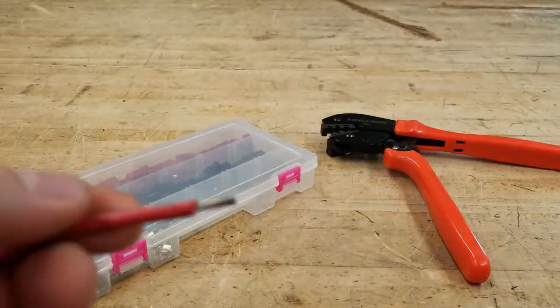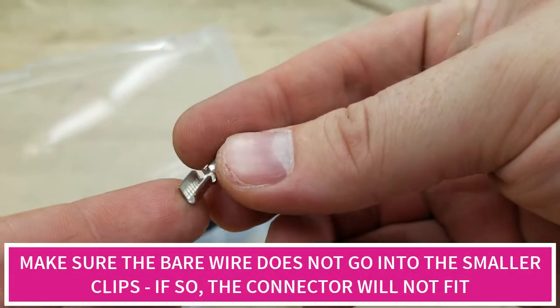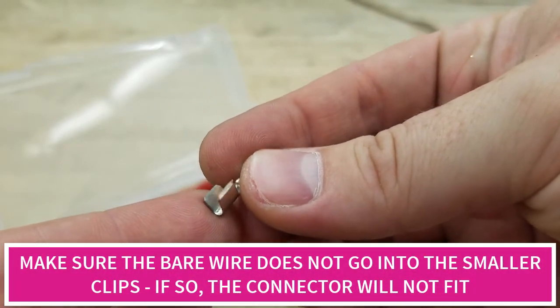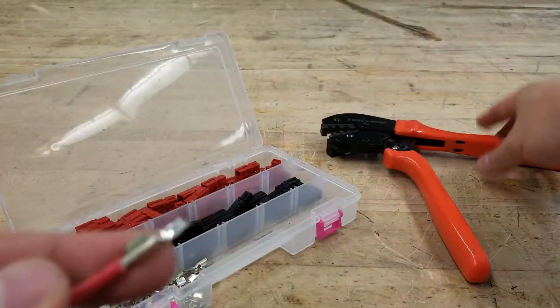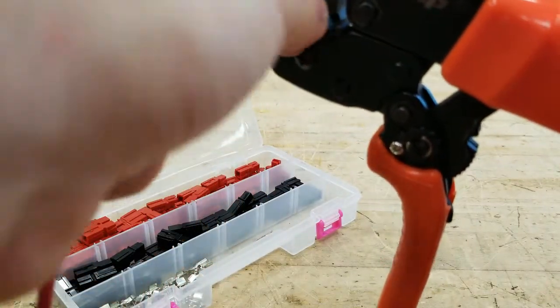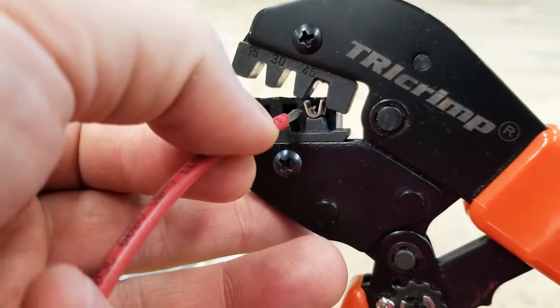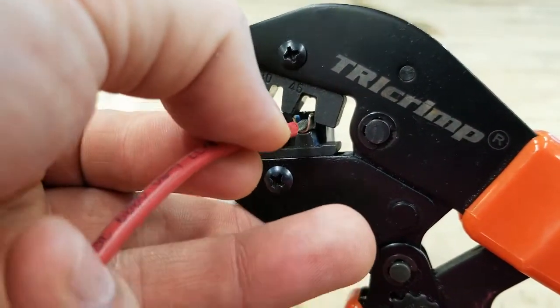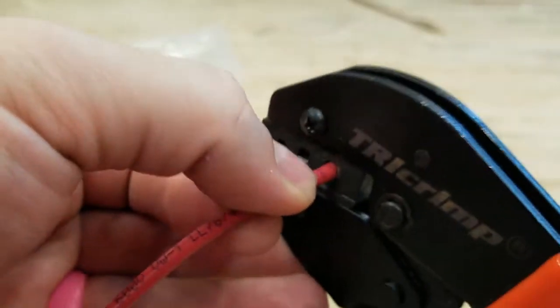The downside is the slightly more complicated process and specialized tool. We are going to start off with the same wire, split the bond, and strip a quarter inch from the end to expose the wire. Now take the metal part of the connector and be sure the wire does not go past the small clamp — if it does, you will not be able to fit it into the plastic housing. Trim the wire until it fits. Then grab the special PowerPole crimper available through AndyMark — a link is in the description below. Insert the metal into the crimper, then the wire, and clamp down all the way.